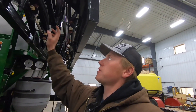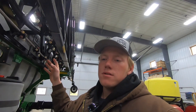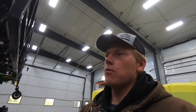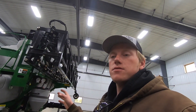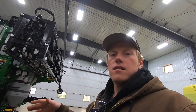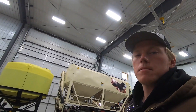This morning Chet and I put all the nozzles on this new sprayer - took them off our other one. For pre-emerge we're going to be running flood nozzles, and we skip two nozzles and put a flood nozzle every third, just due to how wide they are. So I'm going to have to set up my boom height out there too, to make sure that each nozzle is spraying to the center of the next nozzle. Then we'll have that height set so that when I'm out spraying pre-emerge on corn we'll be good to go and covering what we want.